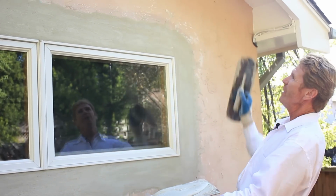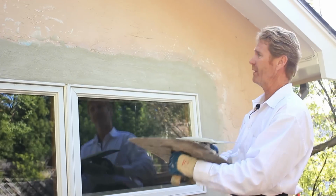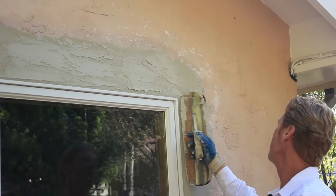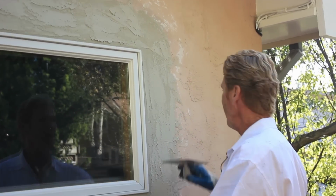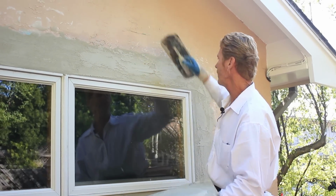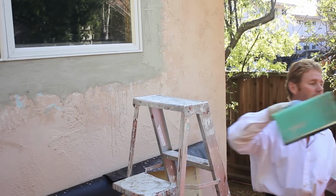Now I'm looking at their texture. They're going straight up and a couple to the right. That's a nasty texture, but I can match that. Here we go. They're kind of sporadic here and there, and they're going upward. Then they barely knocked it down, so that's exactly what I'll do. They left a couple clinkers here and there, so I'll leave a clinker. On a window, we'll take that straight up. And the idea is for the average person not to notice that this is a newly installed window.